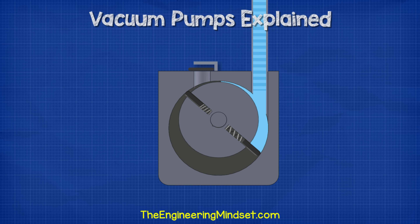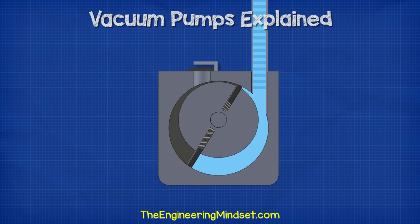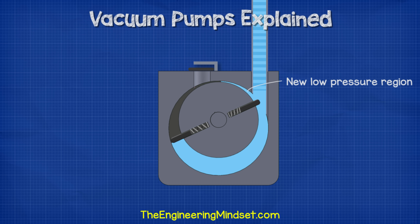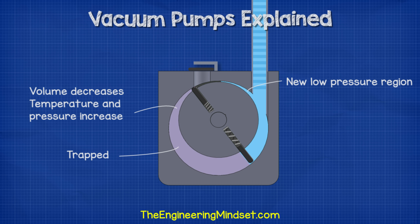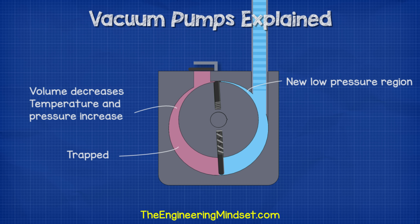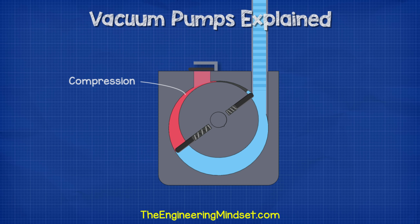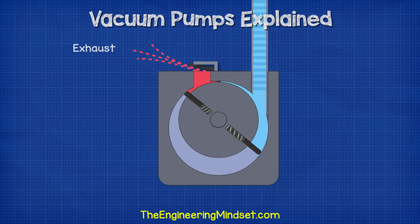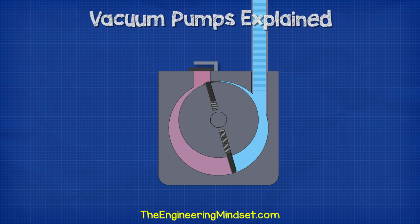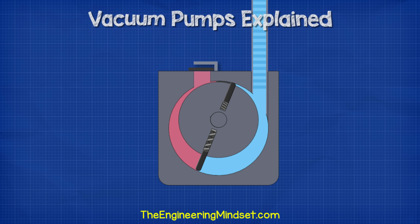But it's actually a trap, because as the rotor continues to rotate the second vane sweeps in and traps that volume of gas in the chamber between the two vanes. The other vane then passes across the inlet and creates another low pressure region, so more gas rushes in from the system to fill this void. As the compressor rotates, the volume of the chamber starts to decrease — that's because the rotor isn't perfectly centered, so we can vary the volume of the trapped gases. This decrease in volume compresses the gases into a tighter space, increasing pressure and temperature, until the pressure becomes high enough to force the reed valve of the exhaust open and the gases are discharged. The compressor continues to rotate, the next batch of gases is pulled in, and the cycle continues.